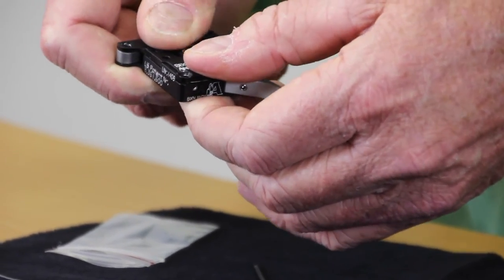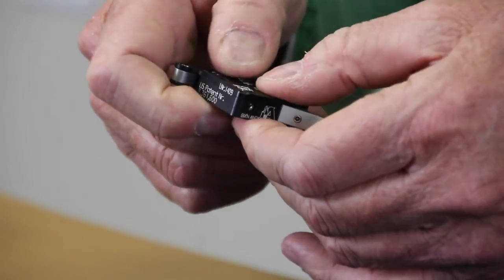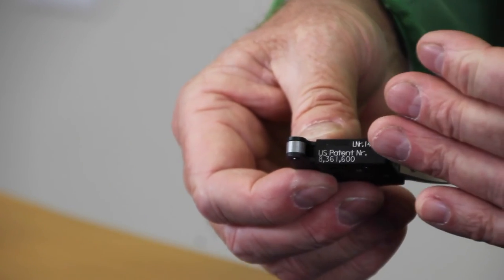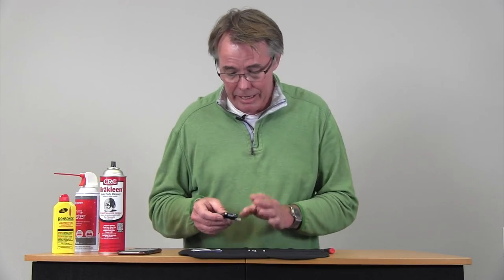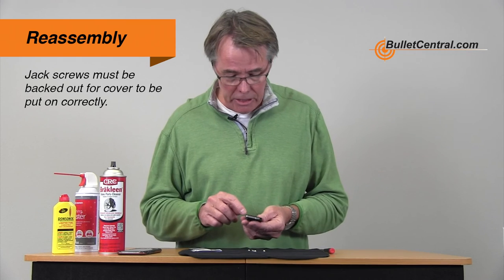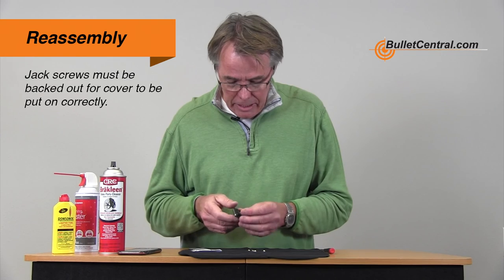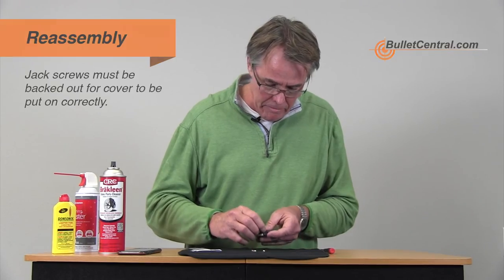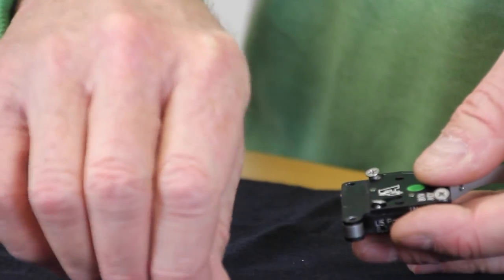Put the lid back on — because these parts have been very tightly machined you're going to have to press it back into place — and you'll be able to see the cover fitting up nicely against the housing. If it isn't fitting the first thing to check is that your jack screws are backed out, as they can prevent the cover from seating properly. Once the cover is seated, get those screws in.